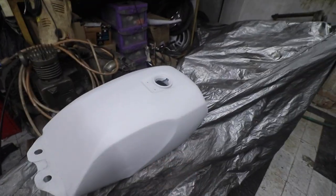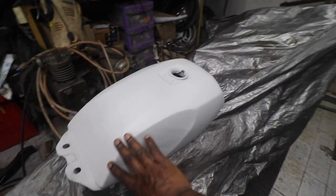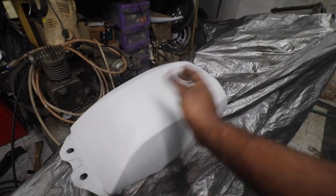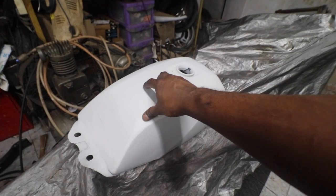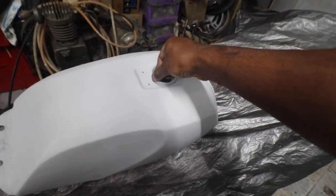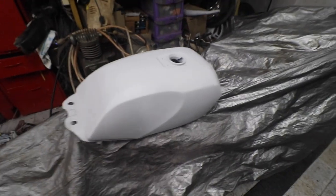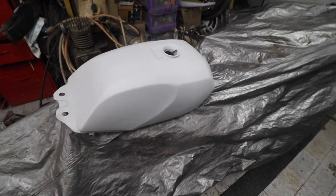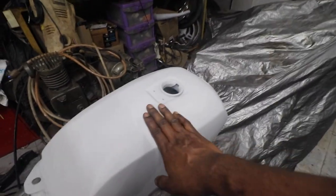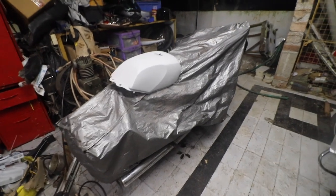I used the chemical stripper and after you use the stripper make sure you wash the surface very well with soap and water, otherwise the new primer or paint that you apply won't stick. The main reason to avoid paint strippers carelessly is that in crevices the paint stripper can get caught, and if it is not washed out correctly the paint will start peeling later on. That is a very important thing to pay attention to.